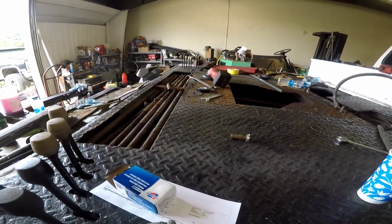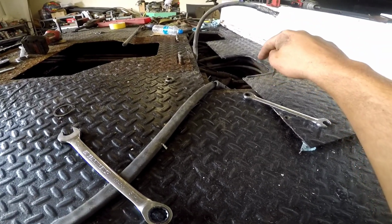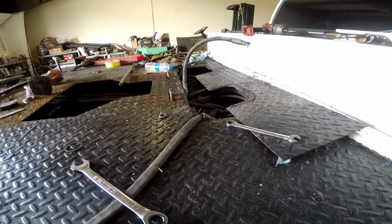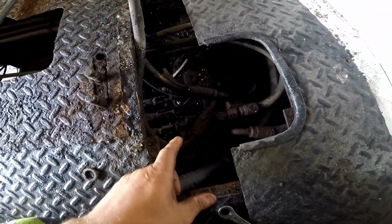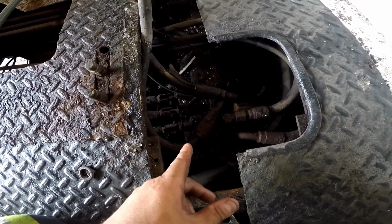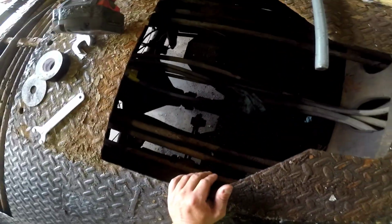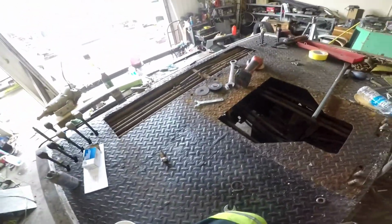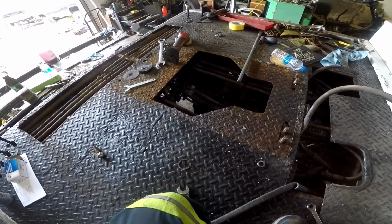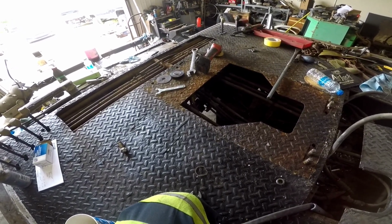And then after I'm done with that, my valve bodies are here. So we got the one here that operates the boom and the winches, and the one over there does the wheel lift and whatnot. Hold on, let me get up there so you guys can see in there. So this is the valve body I've got to replace. So I'll have to custom make a rod that goes to our levers there, which won't be too difficult. I'll be able to just piece something together with some scrap stuff and bolt everything down, make some new hydraulic hoses for the extra winch, and we should be good to go.